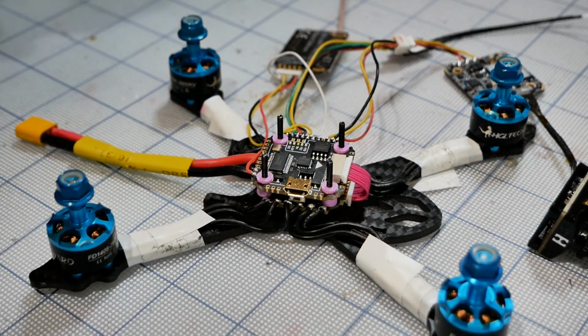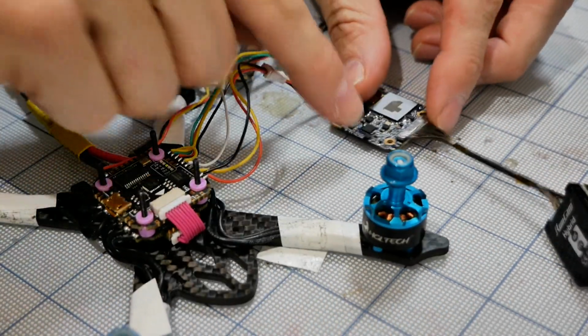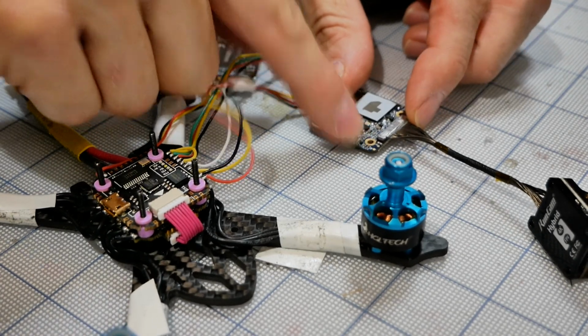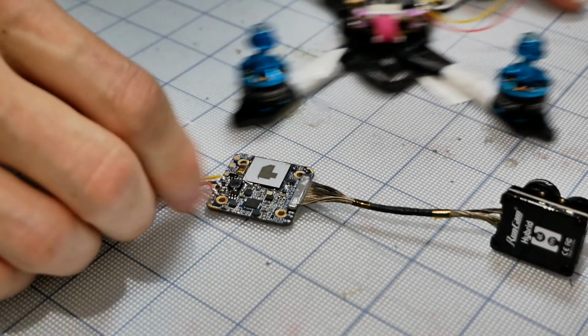So we're going to go back to the bench and we're going to solder the wires onto the TX and the RX, but we're going to leave them long, and we're going to strip the ends, and then we're going to twist them together. We'll do this a few different times just to show you how it flips back and forth, okay? So to the bench. Okay, we'll unplug the battery for now, and I'm going to find a wire to solder onto here, okay? So how about I disconnect this and I'll move it around so I can get a close-up.